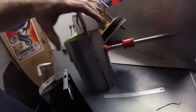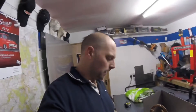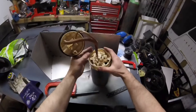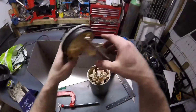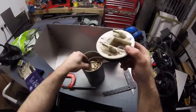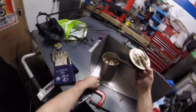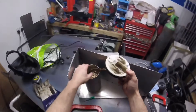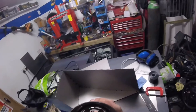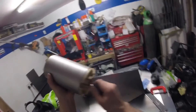I've got it set up inside, I've got a clamp on it keeping it shut, so we're going to put a nice tack up here and then stick another one down the bottom and go from there. We've got this tack welded together and this should fit snugly in there. Oh look at that — that's lovely! Obviously it's not going to be that tall — we'll cut it down and then cut some slots in the side to let the fuel flow through, because we don't want to block it off from the fuel. That's what it's all there for — to suck the fuel up. I'm really happy with that — that's a good snug fit.